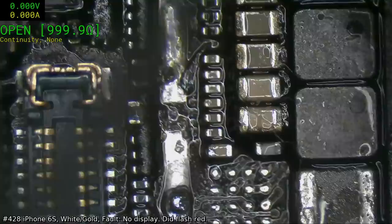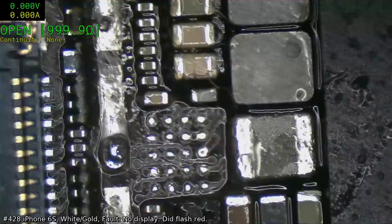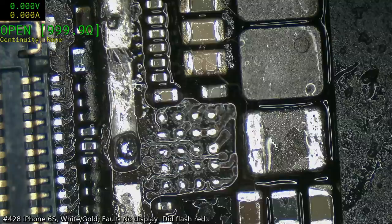That corrosion junk is still up here. Well, they're probably flat enough for me to put a replacement down, but because of the area that it's in and because of our sensitivity towards heat, I'm going to re-ball a chestnut with leaded solder and then put it down.